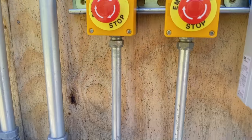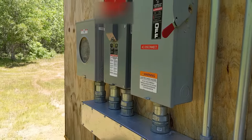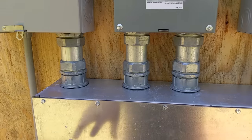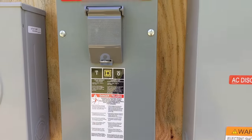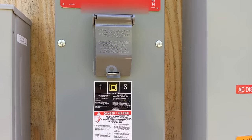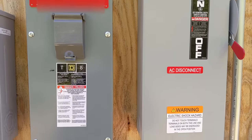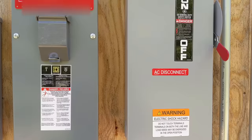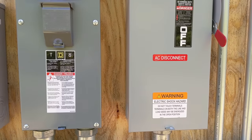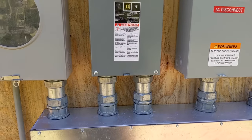Here are our rapid shutdown buttons, which are within line of sight right next to the meter. This is our 100-amp fusible disconnect, and we have line-side taps in the wire trough for selling power back and our grid feed. Everything is placarded up. This is the 200-amp breaker GE panel — shout out to Johnny Valentine, who was very helpful with the selection of these. He has a gift for saving money. The way I was going to go was going to cost a lot more electrically. I was following the manual, and the manual was going to cost me a bunch of money.